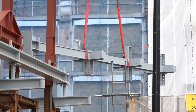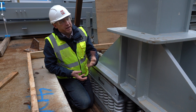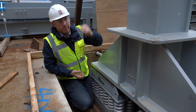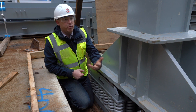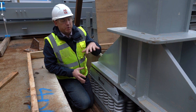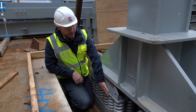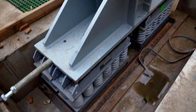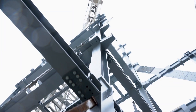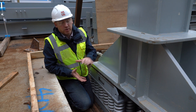That vibration goes through the ground, and if it wasn't interrupted by these bearings here, that energy would carry up through the steel frame and re-radiate the noise inside the hotel suite as a low-frequency rumble — the trains would be audible. These spring packs are tuned to a specific frequency aligned with the modes of energy coming up from the tube lines, and it respects the way the steel frame itself responds to the vibration. Both of those need to be taken into account.